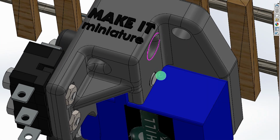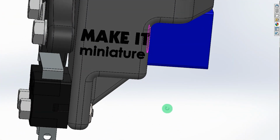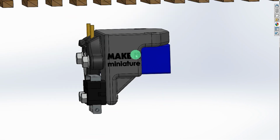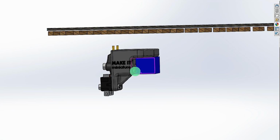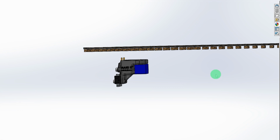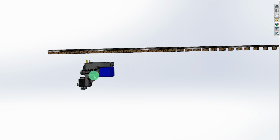And the idea being, if I move this back again, I'm really sorry for doing this, I should have thought about this a bit more clearly. There we go, the wires could come straight off of here, tuck up through here, and then they're already brought out closer to the underside of the baseboard. Just a little way of tidying it up and maybe providing a degree of strain relief just in case these things get pulled. Anyway, that's what I think are improvements.